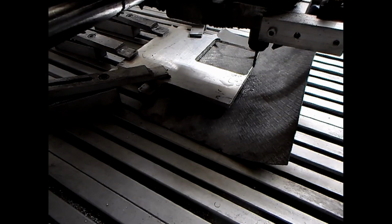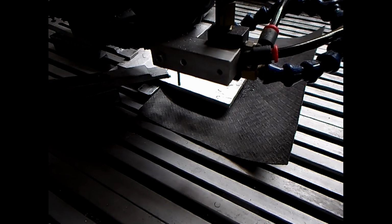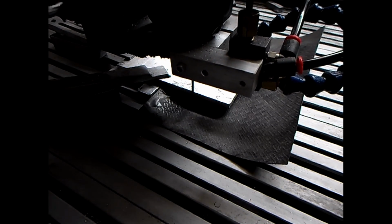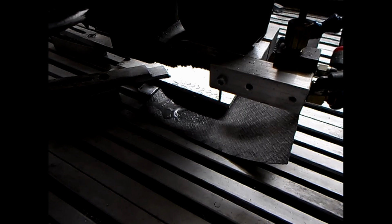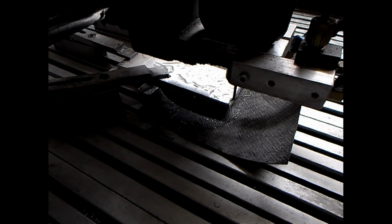This little lathe had a 4-way tool post and HSS tooling. A quick change tool post of some sort is essential as part of the CNC conversion. The availability of suppliers that will supply this kind of stuff to Ireland is very limited, so choice is usually take it or leave it.